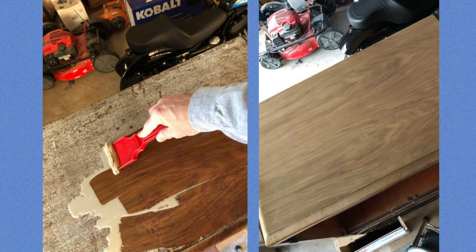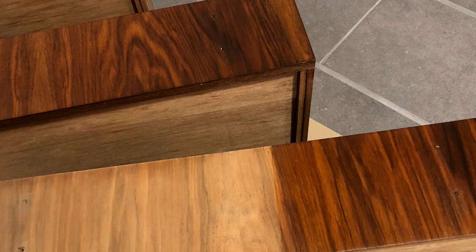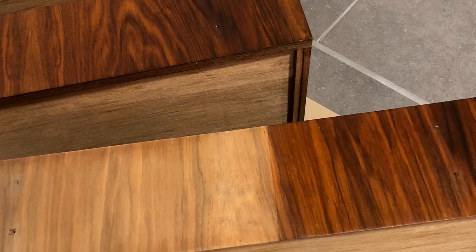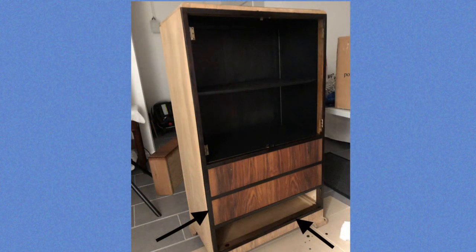While I was able to do much of this work with a power sander, I had to carefully hand-sand the distinct veneer pieces of the doors. I decided then that a multi-step paste wax finish would best bring out the deep colors and patterns of these important features. Other key steps included painting the inside of the cabinet black to mask the beat-up surfaces, and staining the narrow face frame a deep ebony color to bring even greater definition to the doors and drawers.